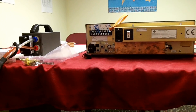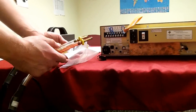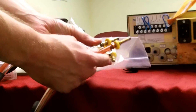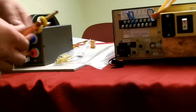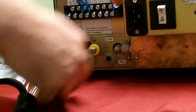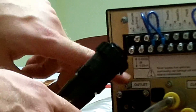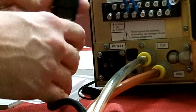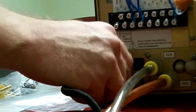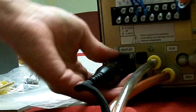Now we're going to connect the heat station to the EZHeat power supply. You will use these adapter fittings to hook up to your lines right here — you'll need two of them. You'll install the clear line into the clear receptacle and the red line into the red receptacle right here. Then install your RF plug into the RF outlet, align it with the two pins, push it in and turn to tighten.